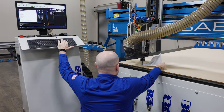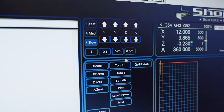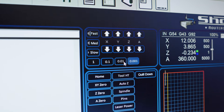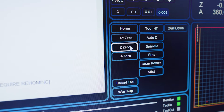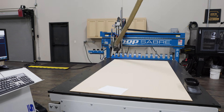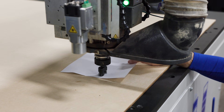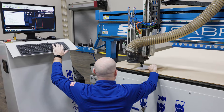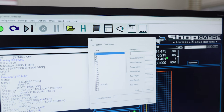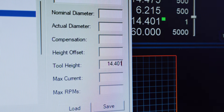Next, I'm going to use the built-in fine-tuning feature on the screen that allows me to move the axis at one thousandth of an inch at a time. Since the paper is roughly four thousandths, I will hit the button four times and then hit the Z0 button on the screen — in this case, zero to the top of my spoil board. Next, I will replace the tool with the second tool. Due to the tool size, we will not use Tool HT on this one, but rather set the tool manually by jogging it down to the spoil board and repeating the paper thickness trick. Now, instead of hitting Z0, I'm going to go into the tool library and subtract the Z coordinate from the value listed in the tool height box on that screen. Remember, when subtracting a negative value from zero, it will become a positive value in the machine.